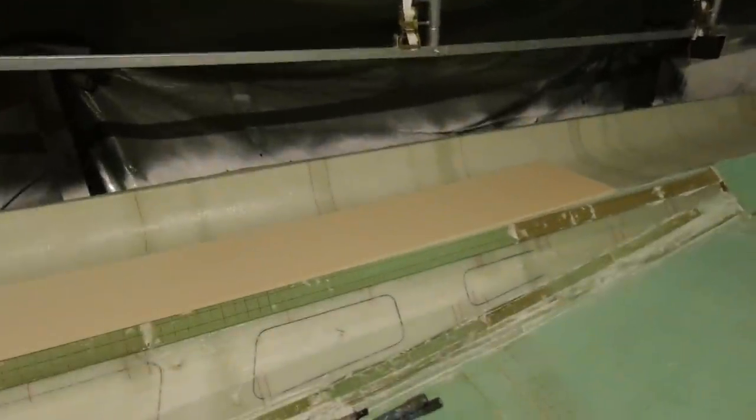You wouldn't want to put a whole other layer on the whole boat. That'll add probably another 50 to 60 or 80 kilos of weight for little benefit when you can strip reinforce, and I'm all about that. You've got to remember we've got bulkheads intersecting with the deck and everything as well here, so there's a lot going on. But for now, that is what's going on along here, the 10 mil, and up into the back here.